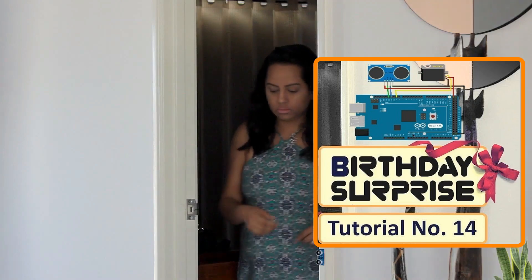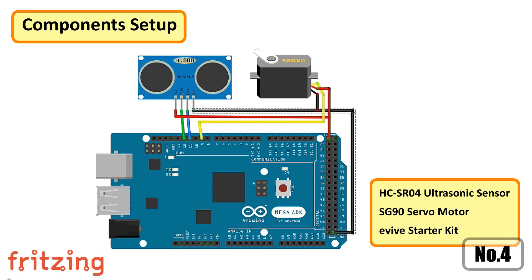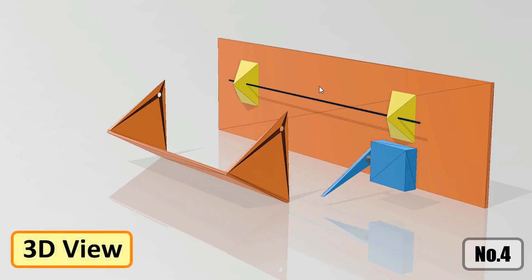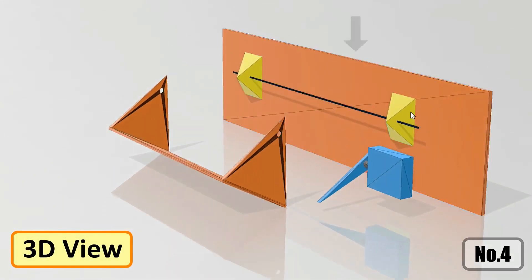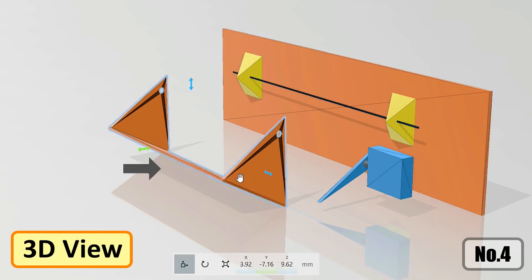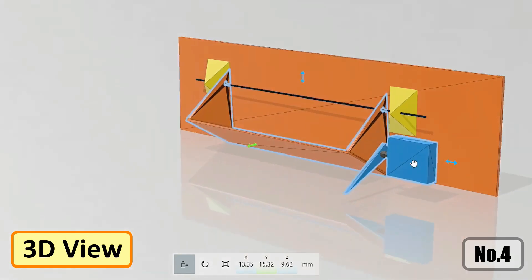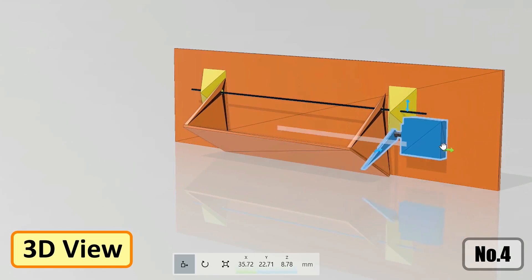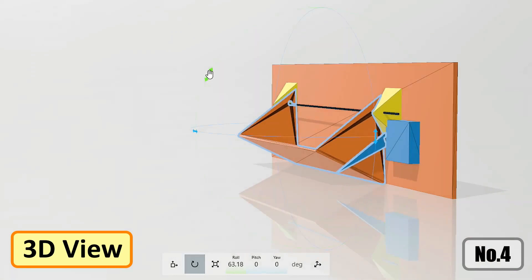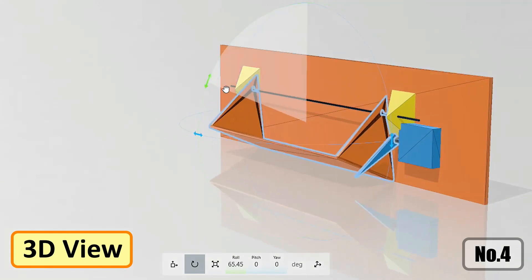The plan is to shower love upon my partner with rose petals as soon as she walks out of the bedroom. Using a 3D model, I'm going to show you the design and working of the flower dispenser. The back bit sticks to the wall and using two holders, it holds a lightweight stick which in turn holds the front bit or the dispenser. I'll put all the rose petals in here. When the ultrasonic sensor detects an object, it sends a signal to the Arduino which rotates the servo causing the dispenser flap to open, and all the rose petals fall. The whole setup is made using a cardboard box making it lightweight and easy to stick to the wall.